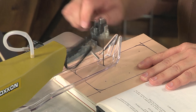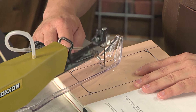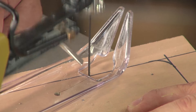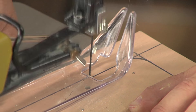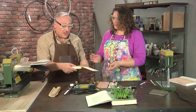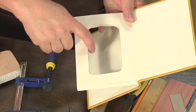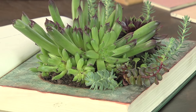Get up to a speed you're comfortable with, safety glasses on, and just take your time — let the blade do the work. Head over to that line, straighten it out, and we're good to go. When we're done, because the nails are only in the center section, the cut-out piece just lifts right out — great fire starter or paint them up and use them as picture frames. If you have a little bump where you started, you can sand it the old-fashioned way or use a power sander, and you've got a book with a niche. You can put absolutely anything in it — coolest idea ever.